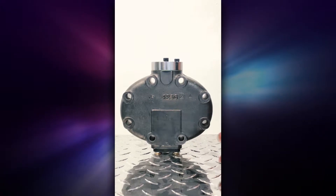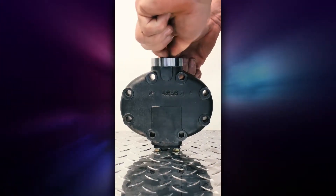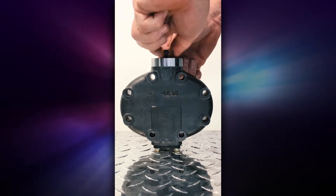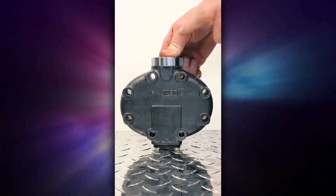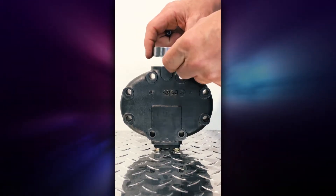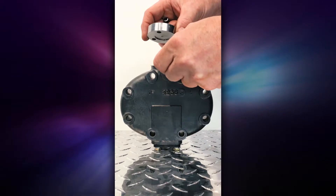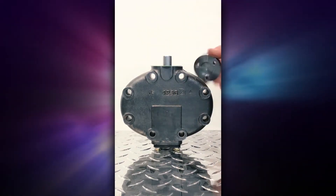Now we're going to remove the plate and install this head. Unlike hot gas bypass, suction cutoff unloading heads do not have an external spring exerting force on this that will have to be removed. The pressure is from an internal spring that you are not going to touch, so you remove the plate itself.